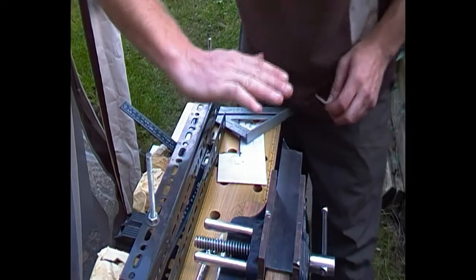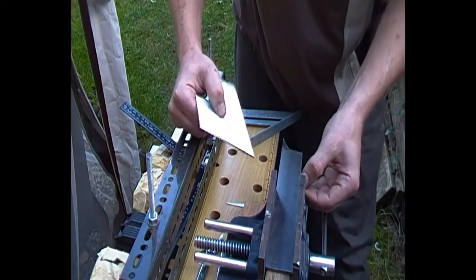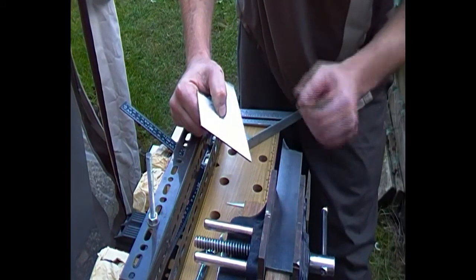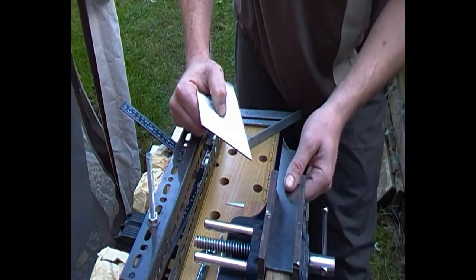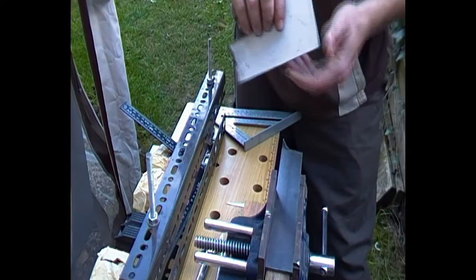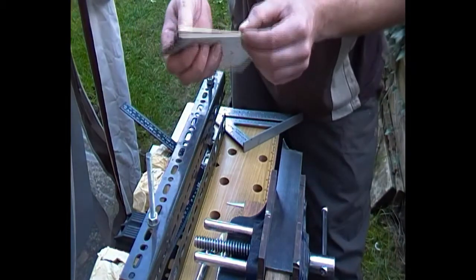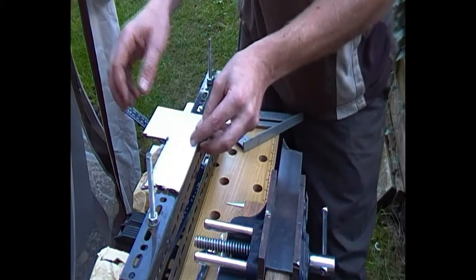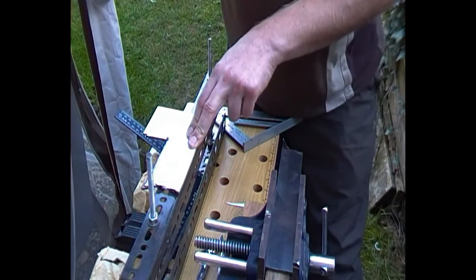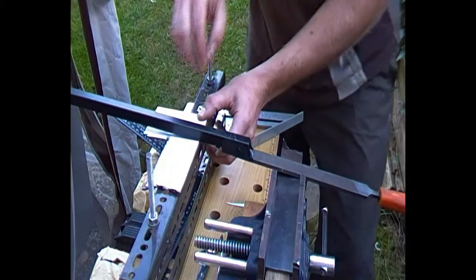Because the angle is going to change slightly as you grind the steel down, it will finish after the hardening process dead on the middle. So you don't want to take it all the way down — leave between half a millimeter and a millimeter thickness on the edge to finish off the grind after hardening. When firing off the scale you'll take material down, and you want to finish right at the edge when it's all done. Since this is 4mm steel, take your 2mm block and lay that on top of the jig — that gives you the equivalent angle it will end up at when finished.